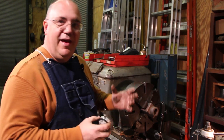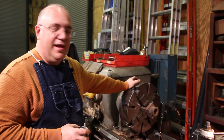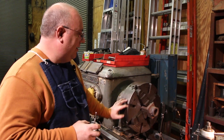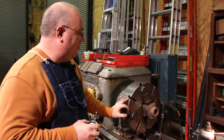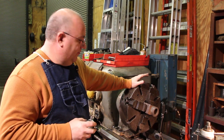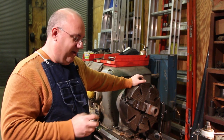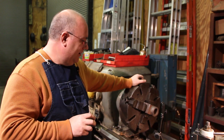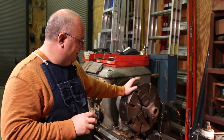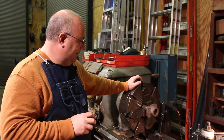So now I'm at the point where I'm going to have to make a lug before I can go back and finish this job that I've actually got started. I put my four-jaw chuck on, got the part kind of in there running somewhat true and needing to be indicated. Now I think what I'm going to do is pull the four-jaw chuck off, put the three-jaw chuck back on, and make my indicator lug so that I can use this properly. While I've got a video going, I'll show a little bit about changing out the chucks on the lathe here.